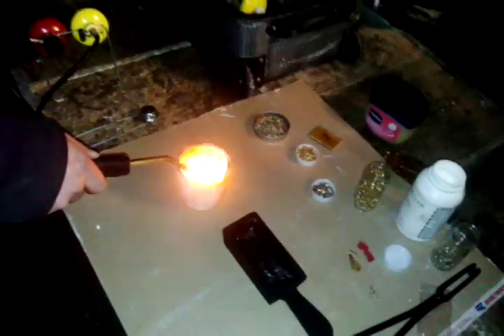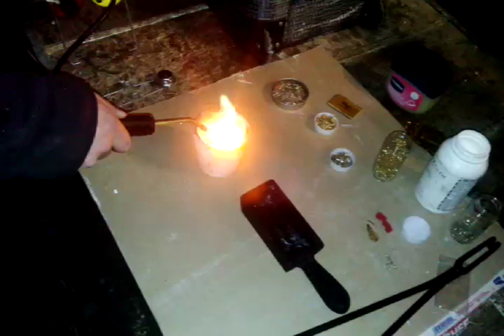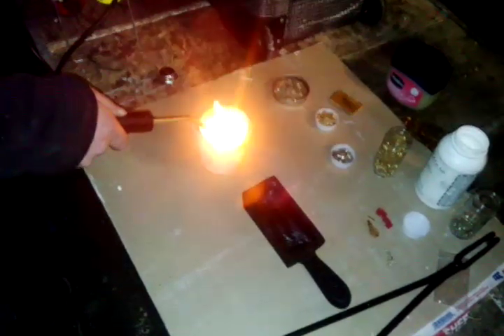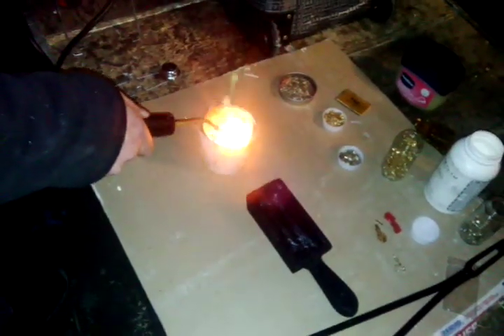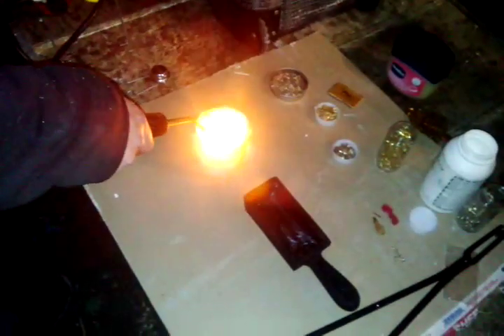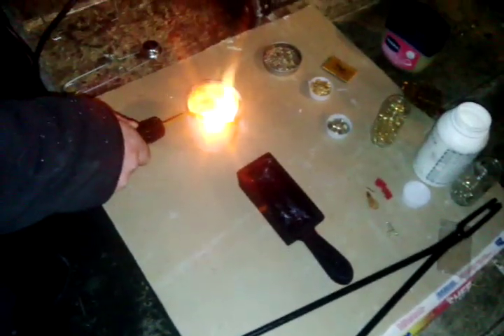I'm going to let it cook for a while so you don't have to watch the whole process, and then I'll create another video right before we pour it. You can see a little green flame coming out — that's the copper being melted out. Remember to add a little borax to make sure any impurities get melted away, leaving you with a more pure ingot. Stay tuned for part two on smelting gold recovered from scrap computers and scrap electronics.